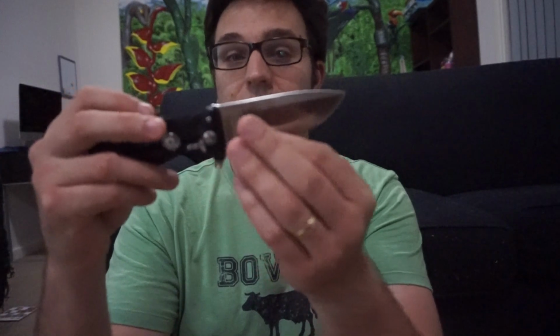What I did to steepen the edge angle, and I very rarely use this belt, I used the green Work Sharp belt first, and that took quite a bit of material off the edge, making it a sort of taller angle convex rather than what really was quite a thick convex like this. So that did a good job of making it slice, you know, better than the factory edge ever did.